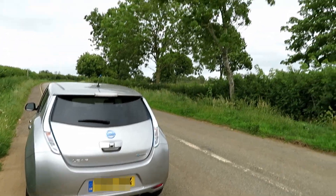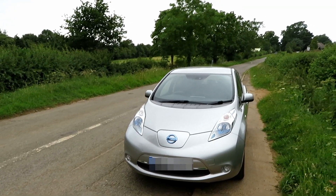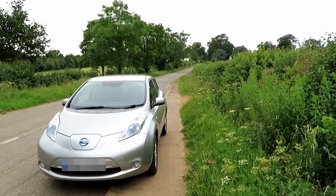I've come out to site to test the little radios. It's really windy and it's supposed to be June. We've got the laptop back home now. I was even getting interference from the HDMI cables from my CCTV NVR as well — so if you're having problems with a little bit of interference, just check what happens when you switch your monitors off and shut down your PCs. Modern graphics cards can be very noisy. We're using the laptop now so we shouldn't have any problems. We're on channel eight on PMR. We've brought out the Retevis RB615 and the WLN KDC1, which is obviously a very similar radio in a similar bracket, and we shall try from this location.